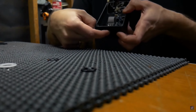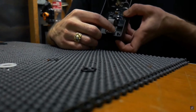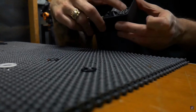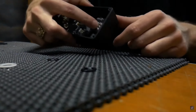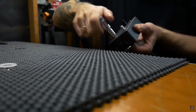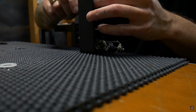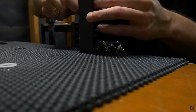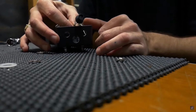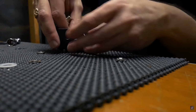But then you just gotta push the LED leads through that circuit board and then push the stomp switch through, get it bolted down, as well as the pots and then the jacks. All right, same with the pots, put the washers and the nuts on, tighten them up. Hold on to the PCB from the back with your other hand. Put the power jack through the enclosure first. It'll make it easier to tighten everything up and then install the input output jacks.